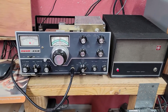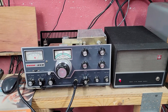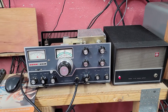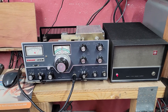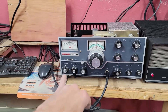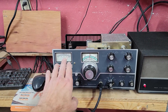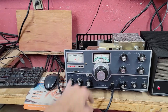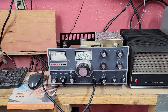Quick and dirty — what to do with a new old radio that you got in. Cap change out. I actually changed the caps on the power supply because I just don't like having the old caps in there. Now I'm not as worried when I walk out of the room and leave it on. I had an SX-25 once that lit on fire, so we definitely don't want that. Looks like I'm getting a pretty good S-meter reading now. I think I might have fixed that weak receive problem — it wasn't even deflecting before.